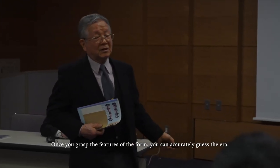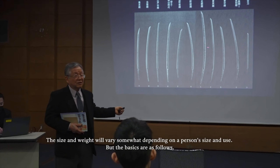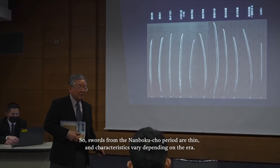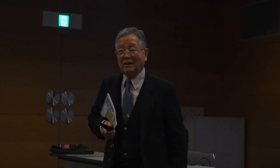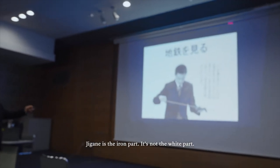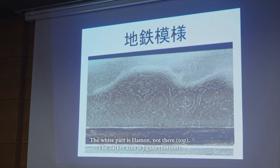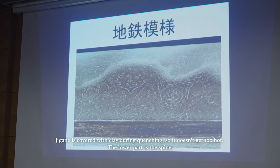These swords were actually much more expensive to make because the steel required was of high medium carbon content and composed the entire blade rather than only the edge. Laminated swords from the Edo to Heisei era were less expensive in Tama Hagane costs, using only Hagane for the edge, than swords from the Heian to Muromachi era using only Kawagane or Hagane. In terms of Kenjutsu on the field of battle, a too-hard edge hitting armor wouldn't be practical and would break easily, as would edge contact against another sword in defense and attack.